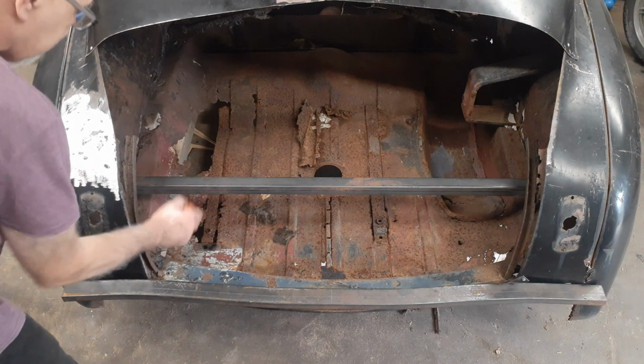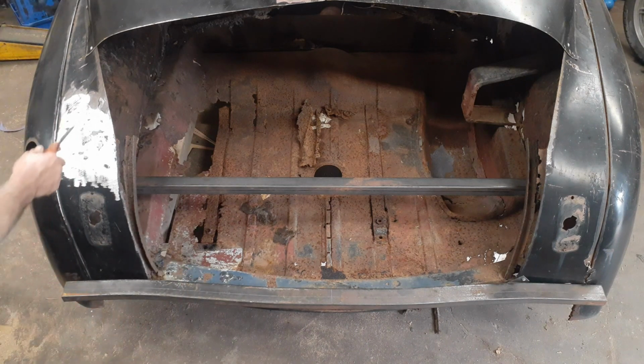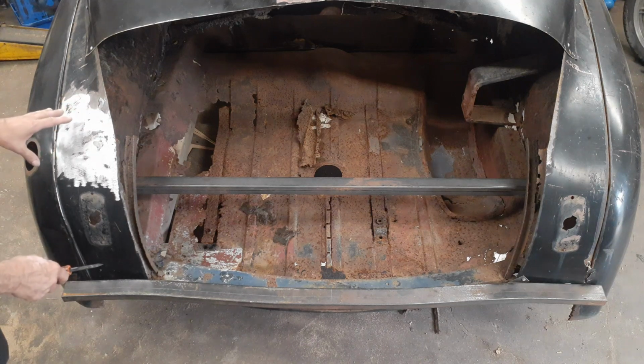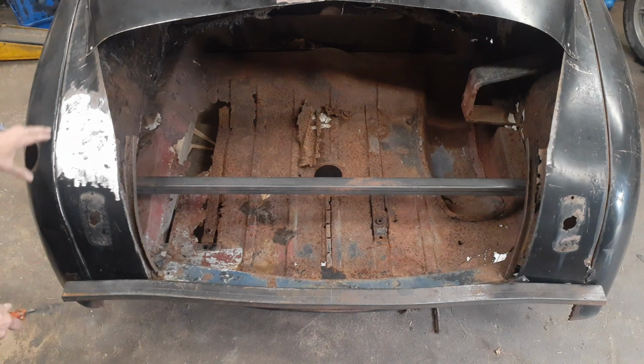With this kind of contraption being bolted on, the amount of mess here and the mess underneath, you might not be able to see it very clearly, but the curve of the bottom of both fenders is different. And the real telltale is this bit of rippling right here. What I suspect happened is when they put this piece on or tried to straighten it out, they didn't get it quite in the right spot. So when they went to put, I'm assuming, a new fender on at some point, they couldn't get it to fit, so they had to bend it a bit to get it to fit.